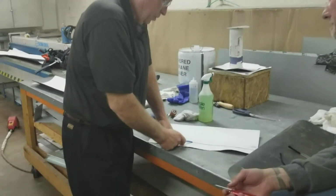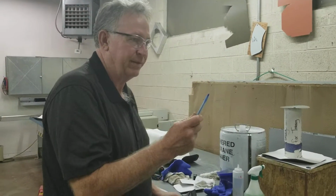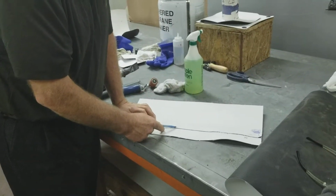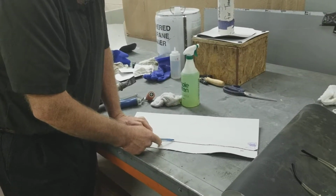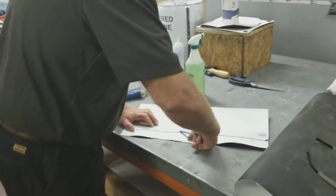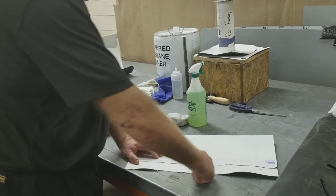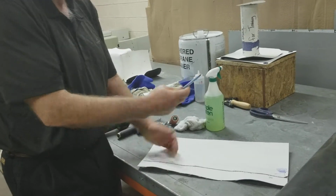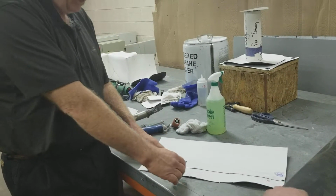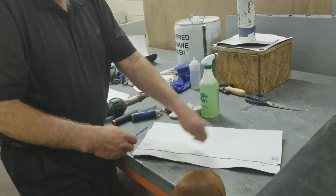No, you just keep your nozzle, just like this pencil is my nozzle, it's a pencil tip. And I stick it inside there, and I'm pointing it at that connection spot. Then I rotate around and I point it at this connection spot. And I rotate around and point it at this connection spot, so I can heat those lines up. And then once I get that, go back and forth a couple times, then you can heat this middle area and then come out and roll it down.